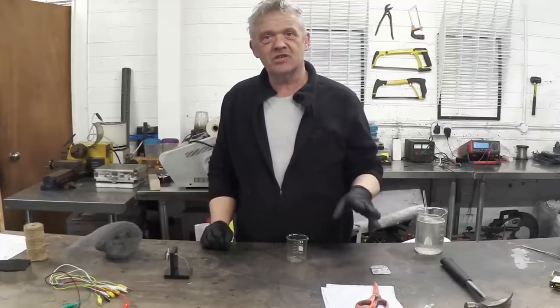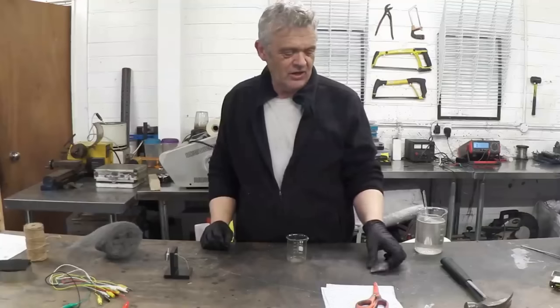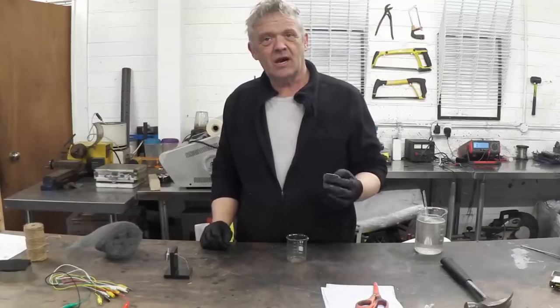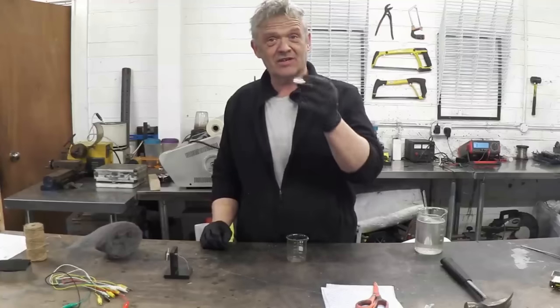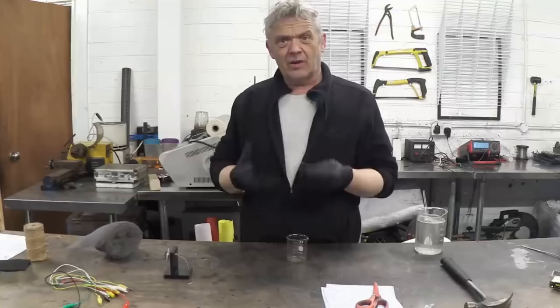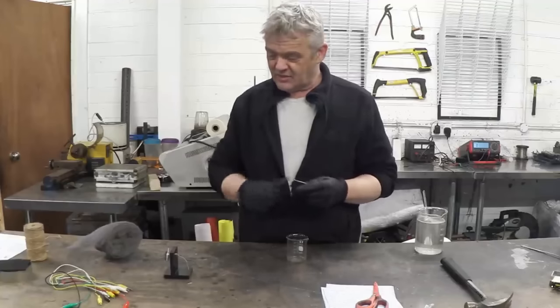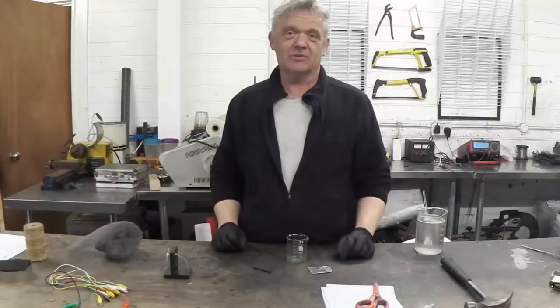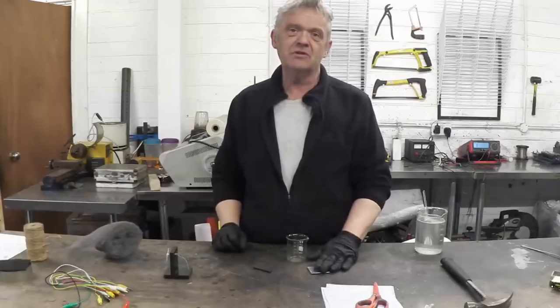If you just put pure zinc in there, you get quite a lot of hydrogen given off. The next best thing we're going to be able to come up with is a zinc case from a battery, which is exactly what this is. It's a zinc carbon lantern battery. There are four in there. I pulled one out, cleaned it, flattened it, and also got the carbon rod out of it. So the materials are really readily available to play with this, and that has been treated already.